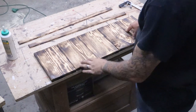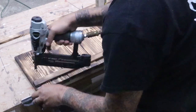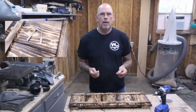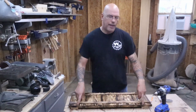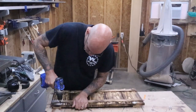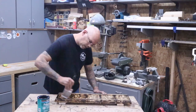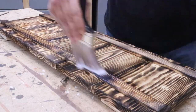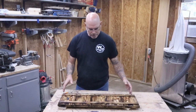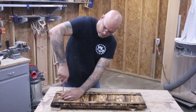These dried overnight, so now we're just going to glue up the edges, glue our strips on, and shoot a couple of brad nails in. I've got a couple of drywall anchors and we're going to put two holes in at three inches from the top so they can mount to the wall. Then we'll put a quick coat of polycrylic on to seal it up so none of the soot comes off in the customer's home. I've got some double-sided coat hooks and I'm going to space them out evenly on the two outside boards and the middle board, screwing them on by hand.